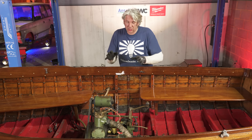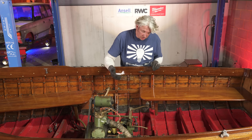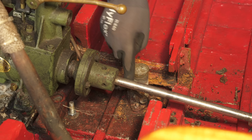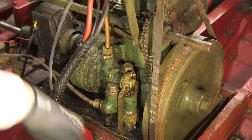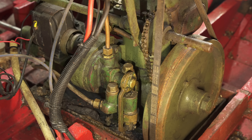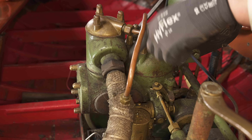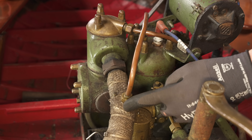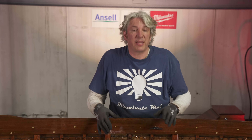Now, if that explains how the two-stroke engine works, there are also these little copper pipes here — these are actually to do with the cooling system. As we looked at earlier, there's a little cylinder coming out of the hull of the boat with a little valve on it so you can turn off the water flow into the cooling system. That pipe goes onto the back where there is the water pump. That water pump then pushes the water up to the inlet into the engine, cooling this expansion chamber first, and then that water goes around the rest of the block through the water jacket and eventually comes out the top, just above the cylinder, and gets spat into the exhaust system. There is no radiator — this is the cooling. You've got an infinite amount of water coming from the river or the sea, which is quite handy.